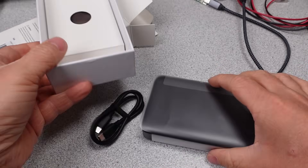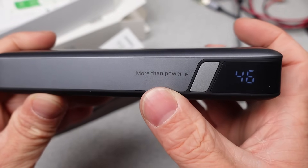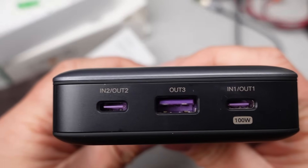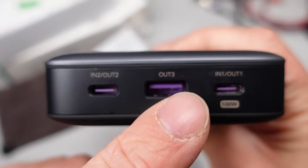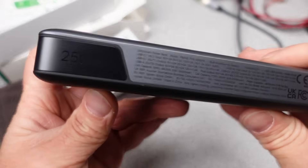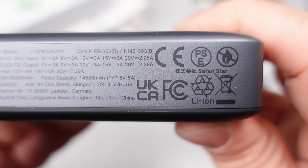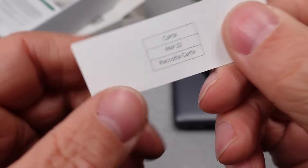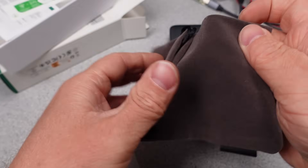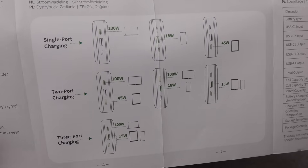The power bank is a little more advanced in that it has both power delivery and quick charge capabilities on three total ports. It can deliver 5, 9, 12, 15, and 20 volts on the USB-C and 5, 9, and 12 volts on the USB-A port, as well as charge from those voltages on the USB-C. This distinctly lacks any PPS modes I could see, so this will only slow charge phones that require PPS mode. The device has a specific port that can deliver 100 watts of output power and is labeled as such, which is a good idea. The other USB-C port can do up to 45 watts. These two ports together will get you 145 watts total — we will have to check later for how long it can sustain this.